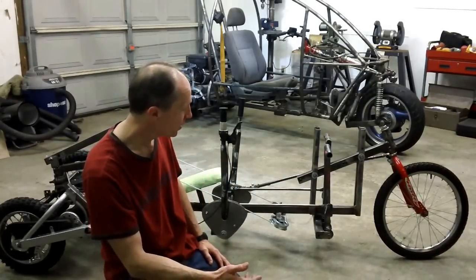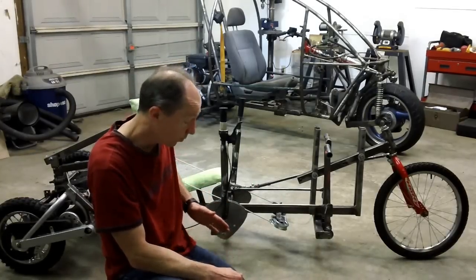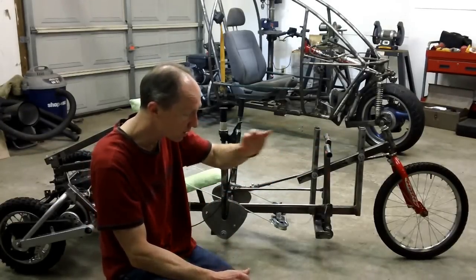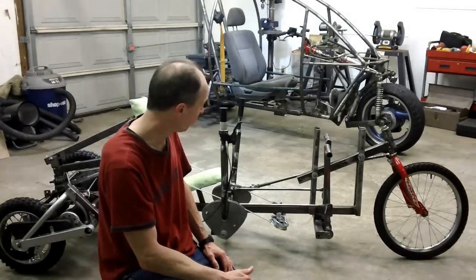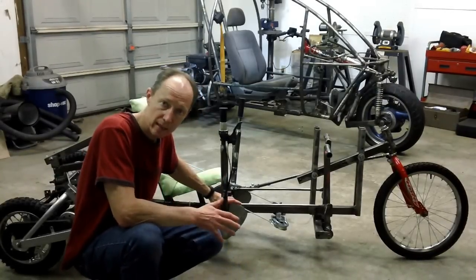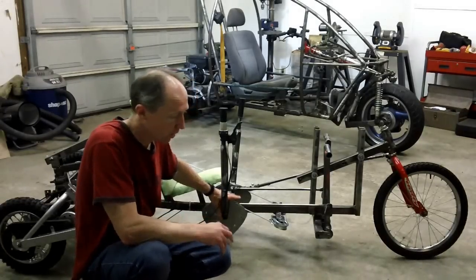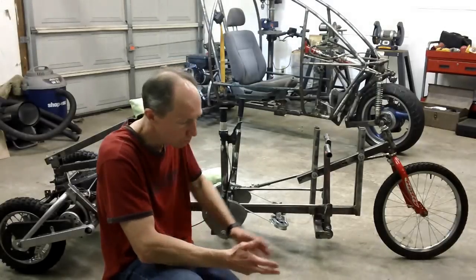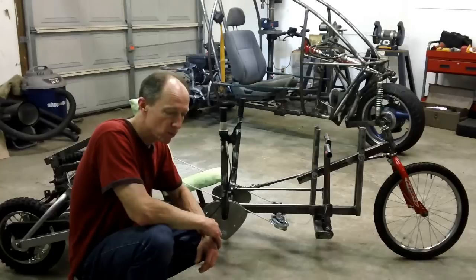And what that causes is tire scrub around corners. And if you're flying around a corner at 70 miles an hour banked, and you hit some bumps, it can be very, very unnerving. Now, what folks have found out is that it's worse if you have a force tilter in that setup than if you have a natural tilter. Others have tried to do uneven length A-arms, which helps to straighten out that bounce just a little bit, and that seems to be helping as well.